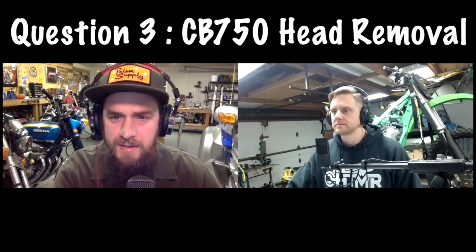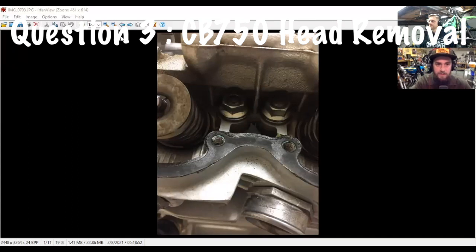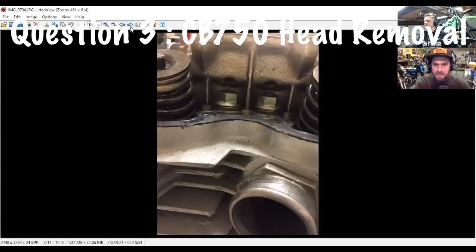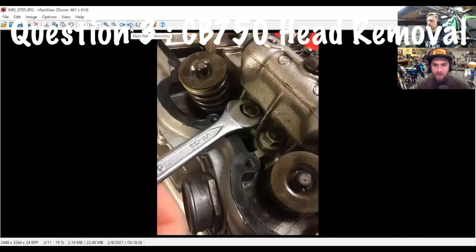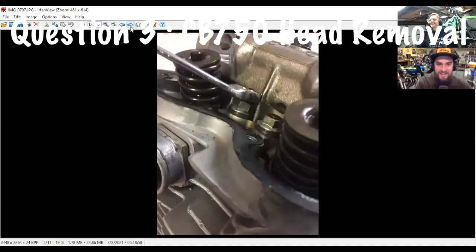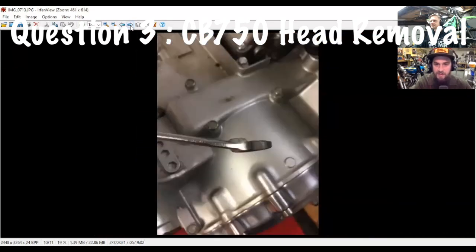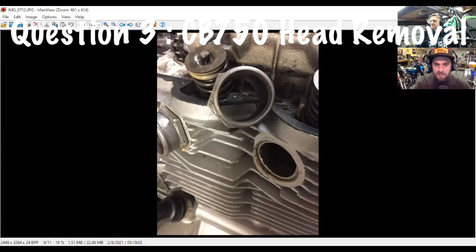Sorry, there are so many and out of sequence. As you can see, they are recessed in the webbing of the casting that supports the rocker arms. How they were torqued up in the first place is a mystery. You can't get a ring spanner on the nut, and you can't turn an open-ended spanner. I had to modify a ring spanner so it would clear the casting and fit over the nut. The mod worked, but I don't know how I'm going to torque them. Just have to estimate, I suppose. Thought this might be of interest to others who come across the same problem.